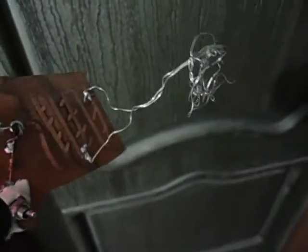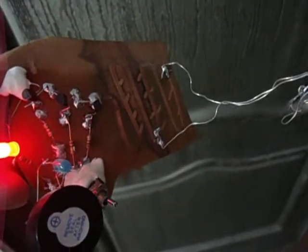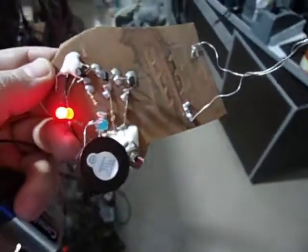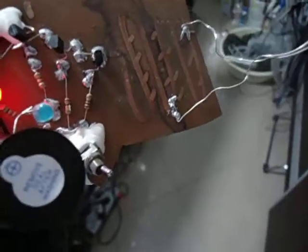This is a really sensitive EMF detector. The reason is I have two coils: one coil designed in the PCB, and one antenna which is a copper wire — it sends the EMF fields to the coil, and the coil translates the EMF fields using these three NPN transistors. Finally, we get light from the LED and the buzzer also makes noise.